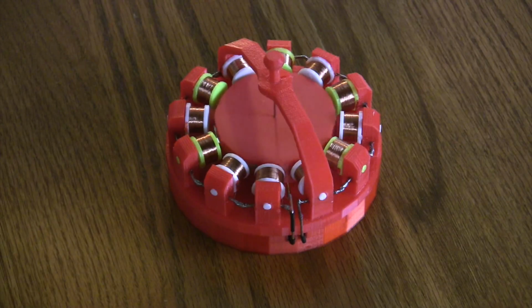At the front, where you can see the wires where the power comes up from the base, the positive goes through a reed switch. And what a reed switch does is it senses a magnetic attraction and then closes. And then subsequently, as the rotor turns, because there's only six magnets and there's obviously 12 spacers, where there's a gap, then the reed switch opens again. That's what causes the pulse.